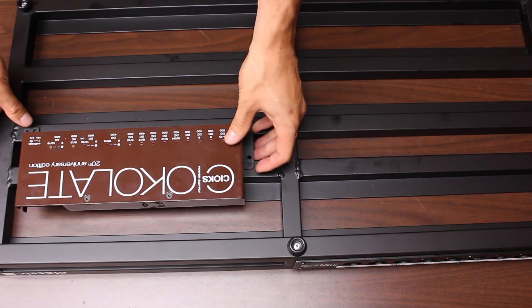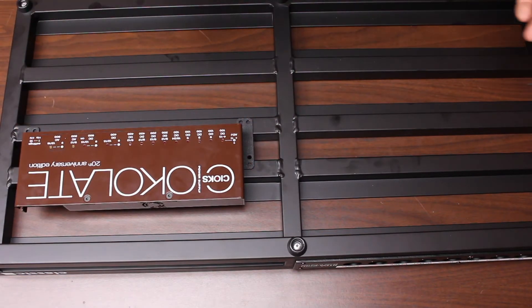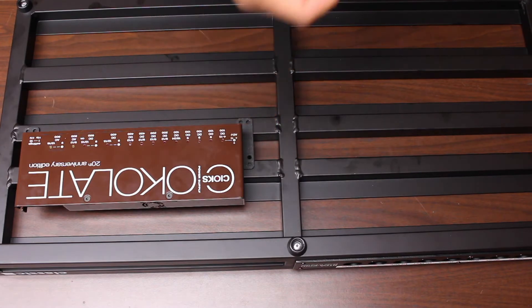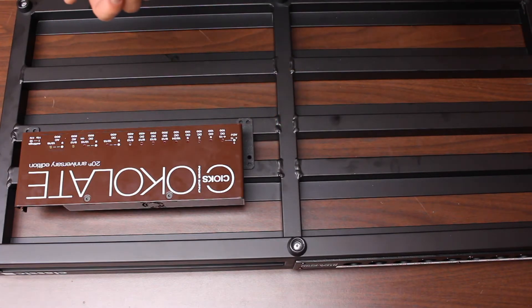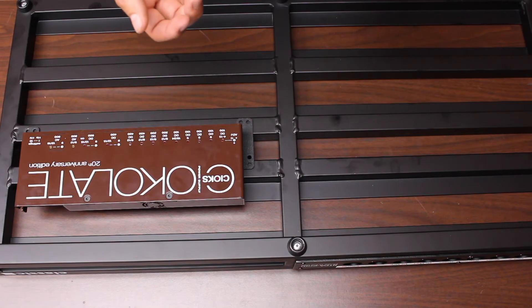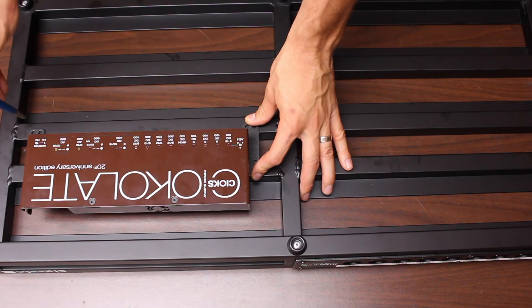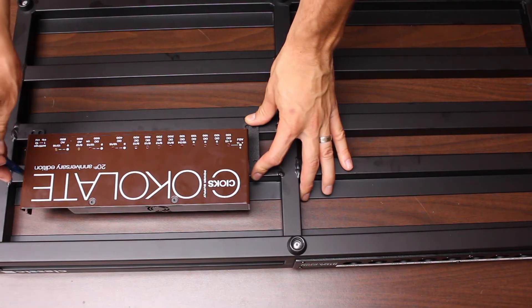At this point, you're going to want to use the 3/16th of an inch or 13/64 inch drill bit to drill your pilot holes. We're not going to use that — we're using our own screws that are self-tapping hex head screws. We just like using those better. The process doesn't really differ; we're not going to drill pilot holes for these. All you're going to have to do is drill the pilot hole, and we recommend using a punch to dot the hole before you drill.